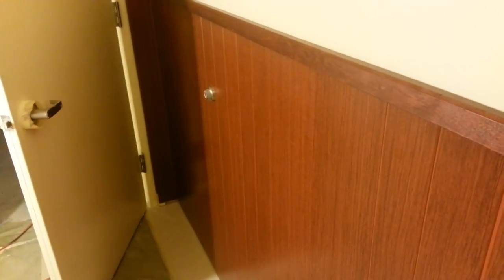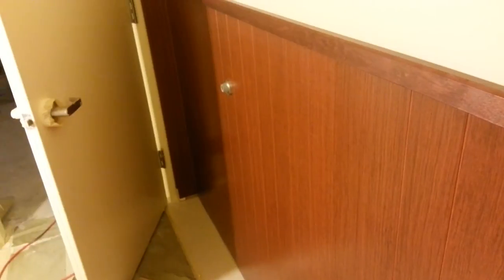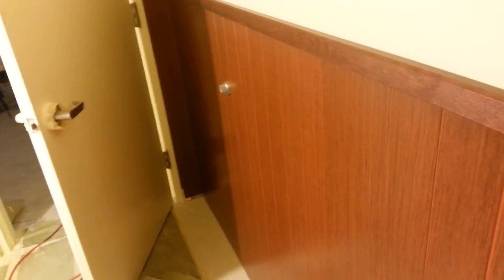In a bathroom, I've seen the floor go an inch in an 8 foot wall, or dip down for a drain or something. Never pull off the floor. And I know people think, when you're unlevel, everything gets harder. Even if nobody notices it, your cuts will be harder, things will be harder because nothing lines up right. The stuff is square and it's made to go in square. So practice making your cuts better and staying level. So this is the profile.